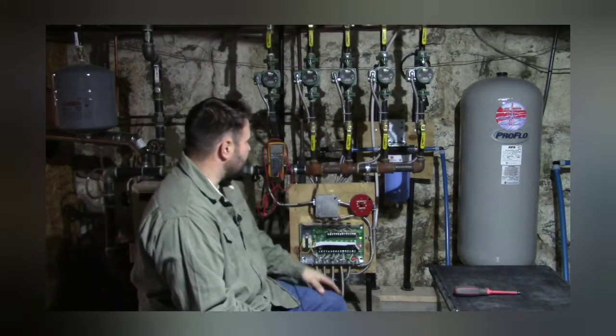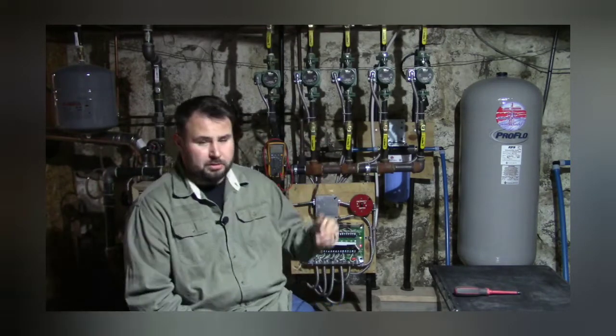I was very excited about it until I received it and realized it won't work with my current setup. I just replaced the boiler — it's a five-zone forced hot water boiler, and each zone has a thermostat. It's just a two-wire thermostat, a bi-metallic on/off switch that relays 24 volts back to the boiler to signal it to circulate water. The Wyze thermostat requires a common wire. If you have three wires or more, you can use their adapter at the air handler or boiler, but in my case it's not that simple.